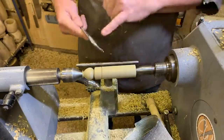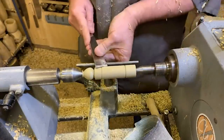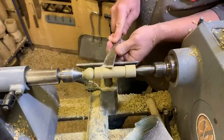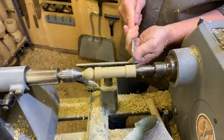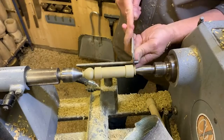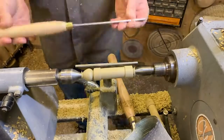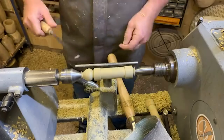I'm swapping between the two tips — rolling with what we call the heel, the short tip — but all the V-cuts and detail I'm putting in with the toe, the long tip. Someone is about to get the Woodfast 350. What size of your signature chisels will be best for a smaller lathe? I use this biggest one the most, but what I like the most is the small 12 mil one because it's so well balanced. Most of my small work will be done with that one, so I would probably go medium to small.